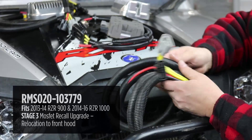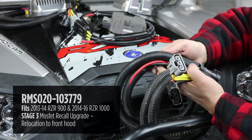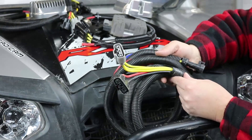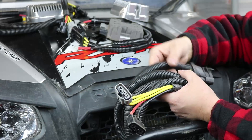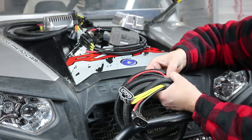There's an easy way to do that — you have a tunnel where the drive shaft runs, so it's very easy to route the harness through. But you do have to remove the drive shaft tunnel cover, the seats, and the rear access hatch. You also need to pull the hood up and find a place to mount the regulator up front. So there's more effort involved, but this is the ultimate solution — it gets your regulator up front where there's much cooler air and no dirt and mud.